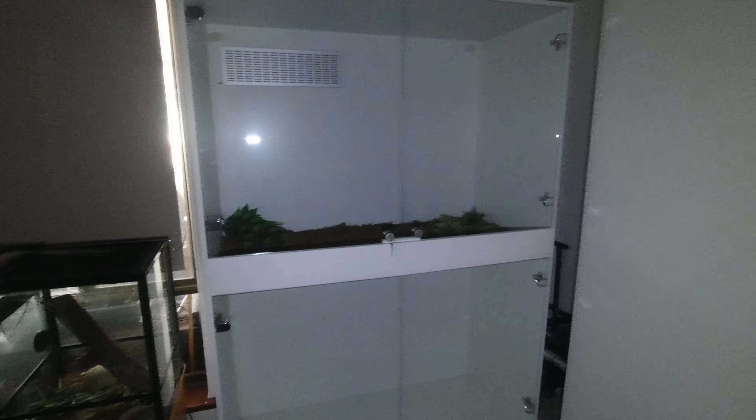Alright, so the enclosure is built. I finished off the locks. When this opens, if anybody's a cabinet maker or joiner you'd actually be proud of me on this one. This is actually a solid piece of melamine — I chiselled out like 10mm by 60mm and put that block there. It's got the screw hole for the lock and it's also something for the door to lean up against, so the depth of the door is even the whole way along. This hole landed right in the middle of this, so I had to do something pretty special. That little block took me quite a while to make.